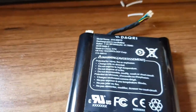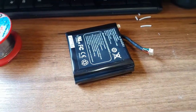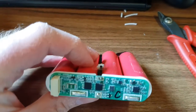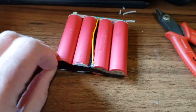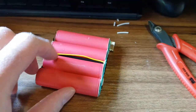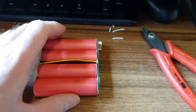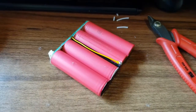First thing I've got to do is peel it — take the outside covering off, get the cells out, see how they're configured, and then rearrange them so they'll fit in the car. Here's the pack after it's been peeled. There's a protection piece on top which we can remove, and it looks like we've got two negative ends and two positive ends, so these are connected two and two. So we should be able to take that half as one side of the cell and that half as the other side, keep them all series and paralleled up, and just basically peel it round.